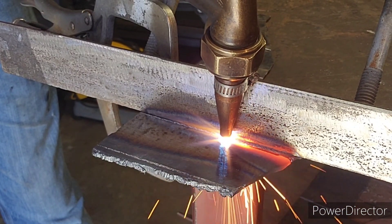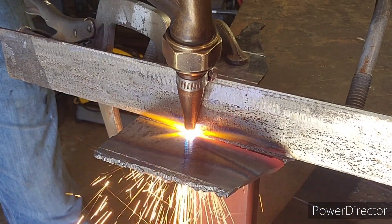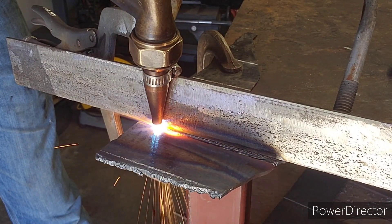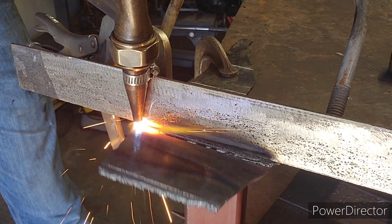For this cut I used the hose clamp on the burn bar and clamped it all down to the piece. Notice how very little preheat I gave - actually I didn't even need any preheat at all on this eighth of an inch steel. The screw of my hose clamp rides right along the top of the angle iron at a nice steady speed, same height off the cut piece, and she falls right off.